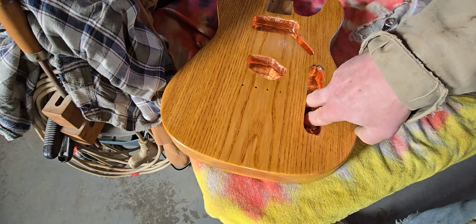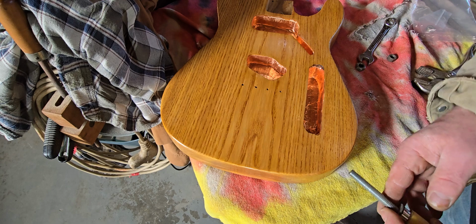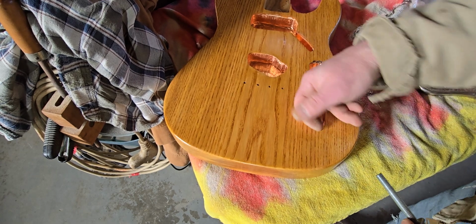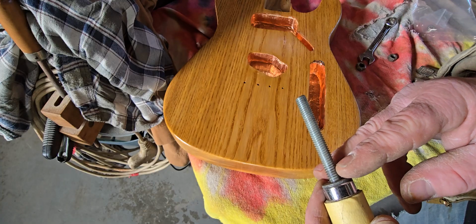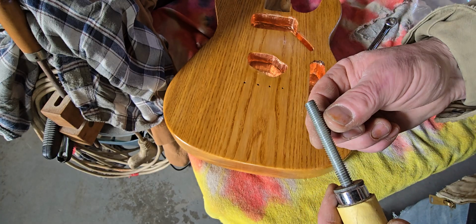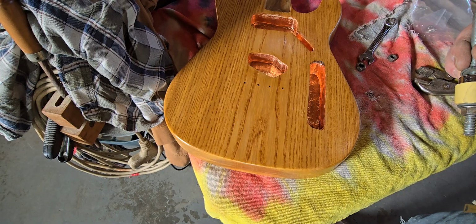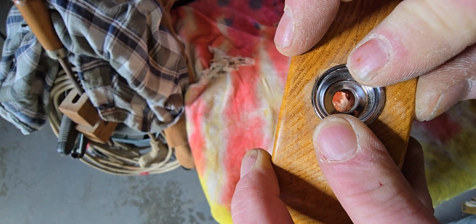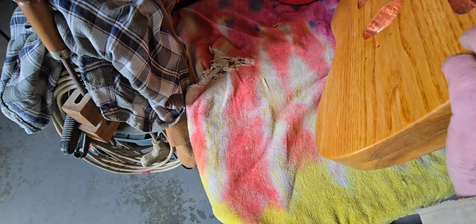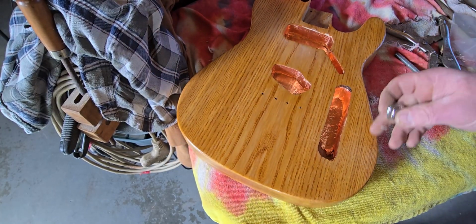Cool. Now, like I said, make sure all the washers come out. So there is still a washer stuck on the back side here, I can tell. There should be one in front of the socket. The little half moon thing was in between that washer and the other washer. We had the two nuts here, so there's a washer inside the body. Don't forget, it happens. Okay, so it's not exactly centered on there, but the bottom of that thimble should be touching that plate. And the plate should be square now and in the hole. Looks pretty good, and it touches the plate, so we're good to go.